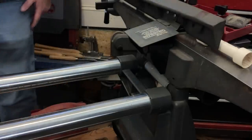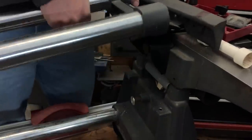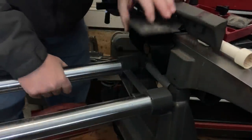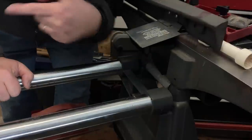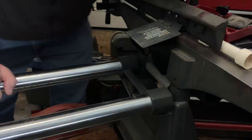If you have a single set screw, you're aligning the points at the other end of the machine — this is not true of the Mark 7 because of the way the Mark 7 moves. If I unlock and raise the tube up into the drill press position, there's a very large set screw I can adjust. Raising that tube moves the spindle towards the operator; lowering it moves the spindle further away. At first I thought this would throw everything out of kilter, but what I'm doing is taking out any existing twist. That adjustment is something you should only have to do one time.